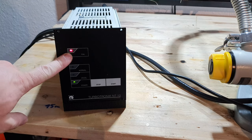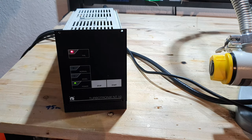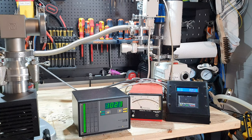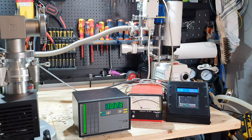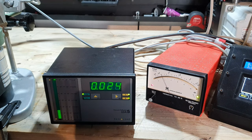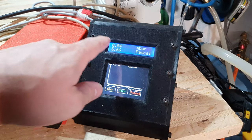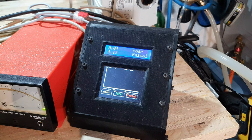I've gotten a fail error and I'm not sure why — I'll have to check the manual. I've installed another pressure gauge at the foreline vacuum pump because, according to the manual, one reason for failure could be that the foreline pressure is too high. I opened the vacuum valve on top and the pressure there looks low enough. Another thing I noticed: when I close this valve, you can see the pressure gauge on the vacuum chamber rising steadily, so I think I have a leak somewhere in my vacuum system.